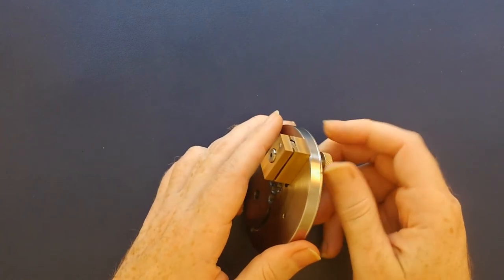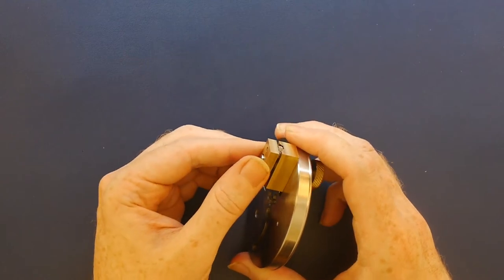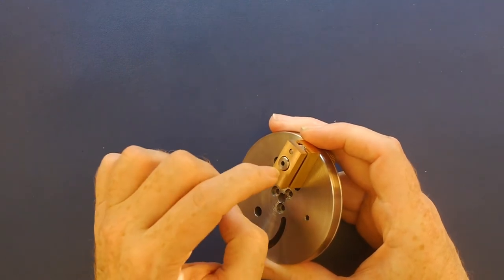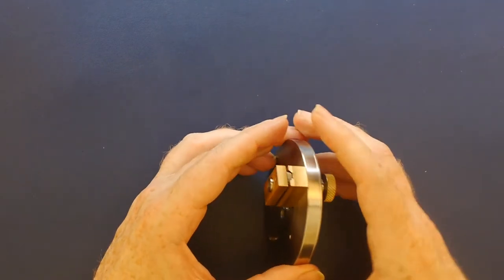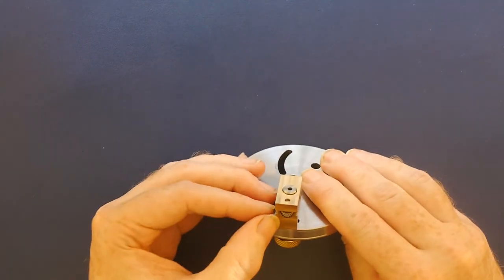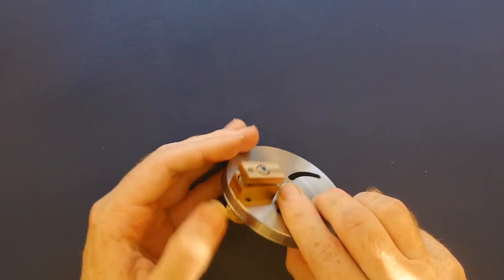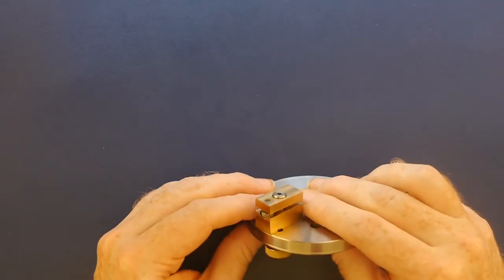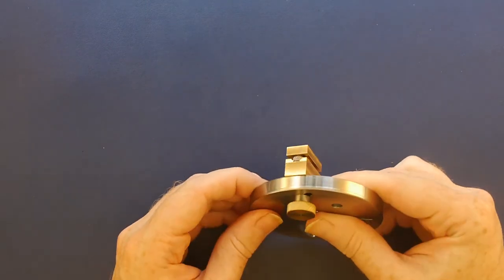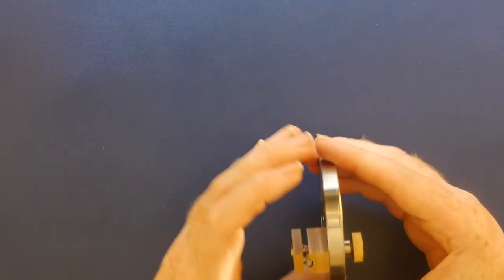As a prototype, I'm pretty happy with it. There's a lot too much flex around the top of the top jaw, which I think is due to the tolerances around the central shaft and jaws not being tight enough. Despite all my efforts, the rear shaft isn't very coaxial either, and in certain locations it can push the jaw out of position and can even jam slightly. The thumbscrew and spacer work fine, so I'll keep those parts unchanged.